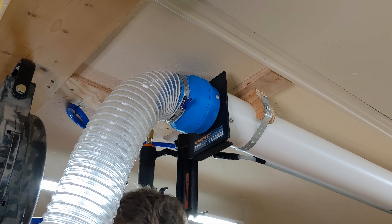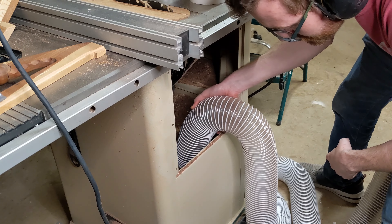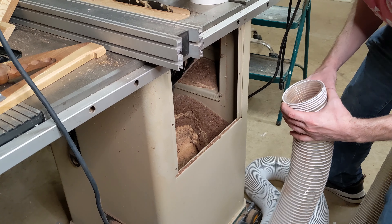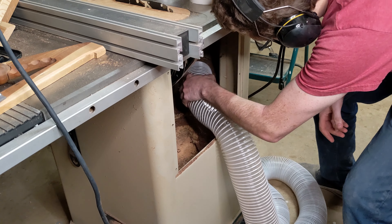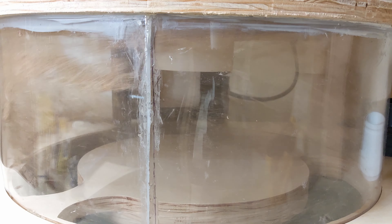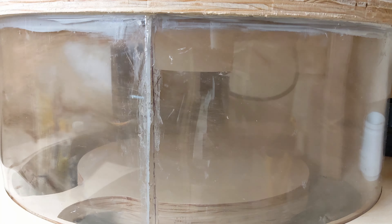That's another functional part added, so I gotta try it again. This setup can move a lot of dust, but in this attempt I think I discovered a limitation of this style of baffle and the reason for the filter box. Once the system gets overloaded by moving dust, it travels straight past the Thien baffle, through the impeller, and fine dust flies everywhere in the shop. I don't think I could produce this overloaded state with dust pulled from an operating machine, but dropping a hose into a large pile of dust definitely does it.